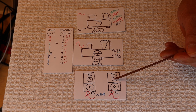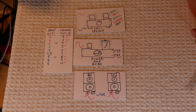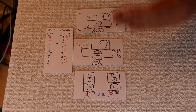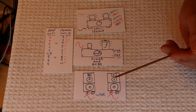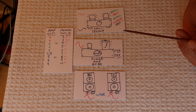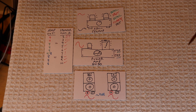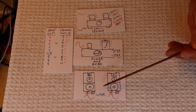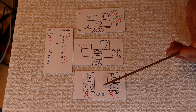You also have a coil of wire behind that big magnet. Inside, there's a coil of wire going in and out — out on the positive phase, back in on the negative phase. That's how sound is created. That coil of wire has inductance. Inductance and resistance together make for a bit of a calculation — but we're not going to get into the math. All we need to know is to look at the back of your speaker. 99% of all commercial speakers have a plaque that tells you the nominal impedance. If the label's gone, just Google it.